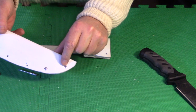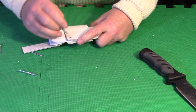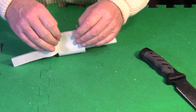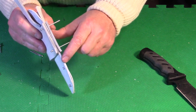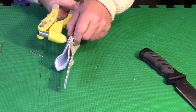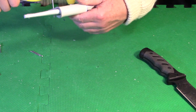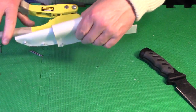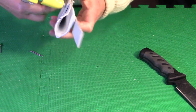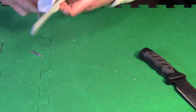I'll show you where I'm going to put the next two pop rivets — going in through the front of the sheath. They're in place now, and there's going to be some work to do to fix this up and make it look nice. I'm going to close those two pop rivets off. For the technique, I like to rotate the rivet gun around to get a nice even mushrooming as it deforms the back of the pop rivet — loosen, come back a little further, until it appears to be as far as it's going to get, then give it a final squeeze.